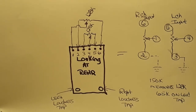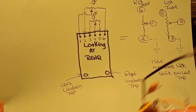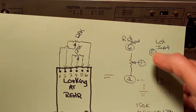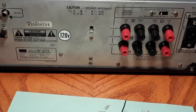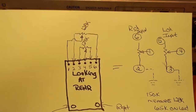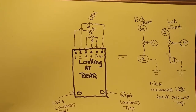There are no errors in this — it's absolutely right. You will be looking at the original Sansui pot from the rear. There's your six pins on top, your two loudness taps on the bottom. Right channel in on six, left channel in on five, and so on. All you have to do is pull your connections off the new pot you want to put in and apply it to this — that will be the electrical part of it. There's still the mechanical aspect, but that's the hard part right there.